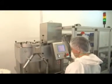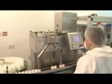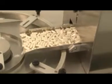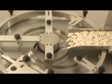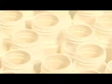Here we can see the potting and labelling process. Empty pots are placed on the turntable and filled with silica gel. Capsules are then distributed from the hopper via a turntable and down through two steel chutes. Each of these chutes has a laser system which counts the number of capsules that goes into each pot.